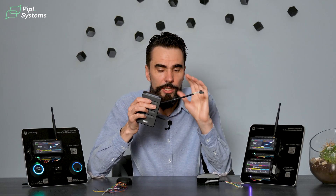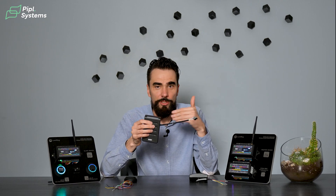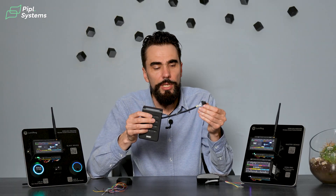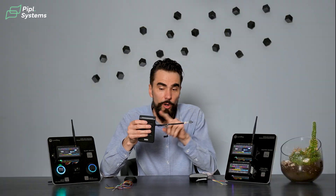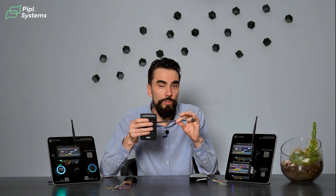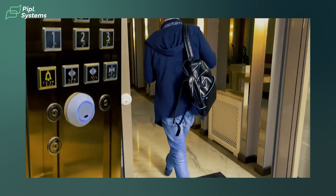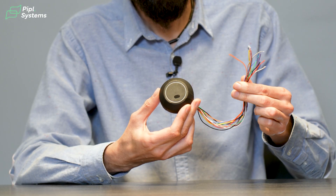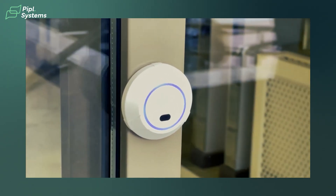Though there is no way to read the data because you can use encrypted OSDP — OSDP secure channel with encryption enabled. In this case the only damage that can be done is that all readers on this line can be taken down if the cable is compromised. There are also devices that support both OSDP and Wiegand wiring, but as you can see, there are many wires on these devices, so it's not the easiest to install.